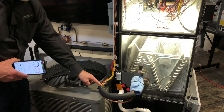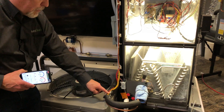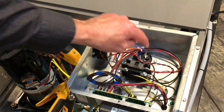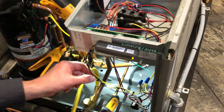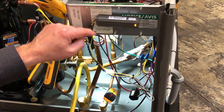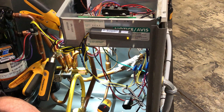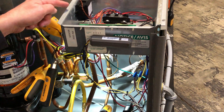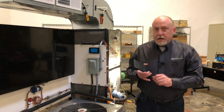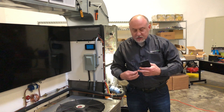Down here is where I've got my liquid line and suction line sensors. The liquid line sensor is strapped to the liquid line; the suction line sensor is pushed underneath and strapped to the suction line. Over here we have another transformer powered right off the contactor, and the white wire is used as a comm wire — so there's no wireless between this outdoor sensor and the indoor sensor, it travels via wire so we always have a good connection. We've got another CT measuring power and power factor, and we're measuring voltage off the transformer — so basically ten sensors total.